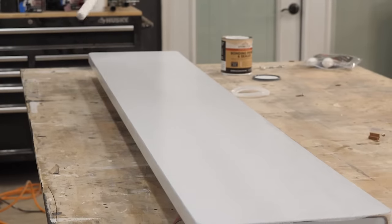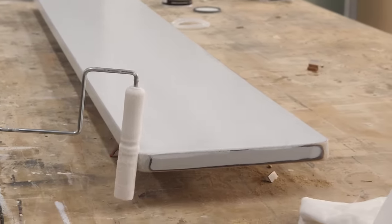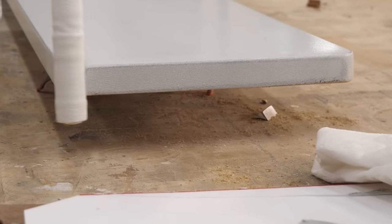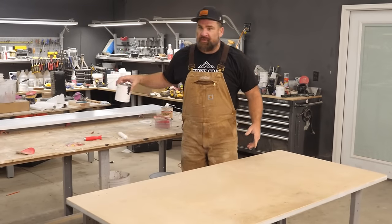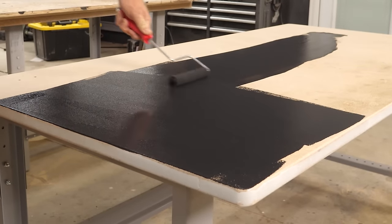And remember, if you're going over your existing laminate and some of your edge laminate is loose, peel it off. Peel it off and Bondo it. It's gonna be a better surface. Guys, don't forget, we've designed this undercoat to bond even with a little bit of dust. Goodbye, coffee stains.